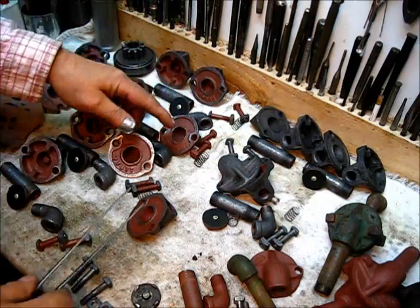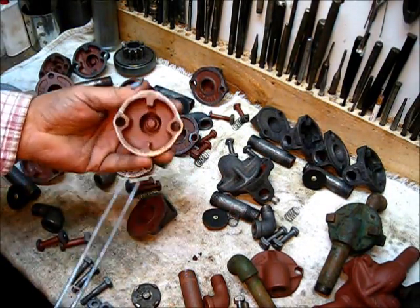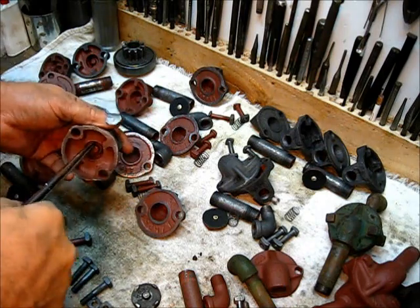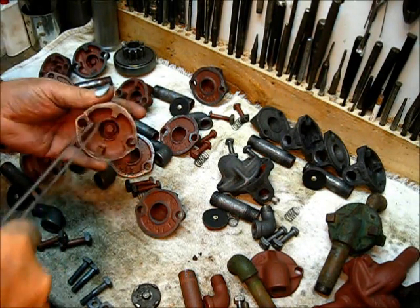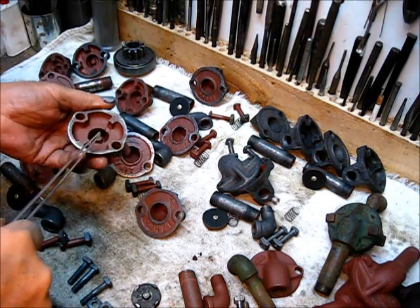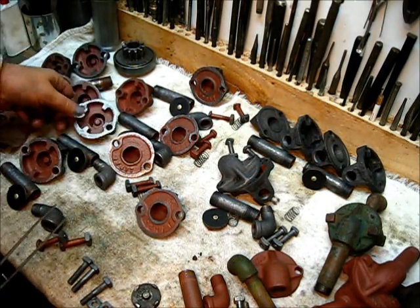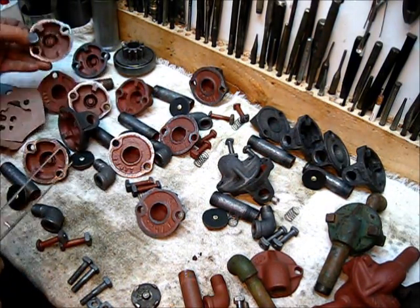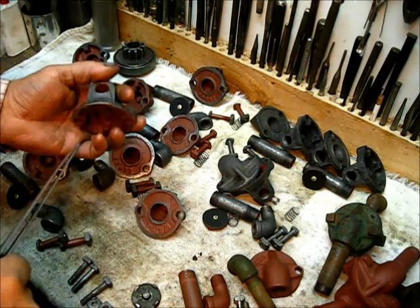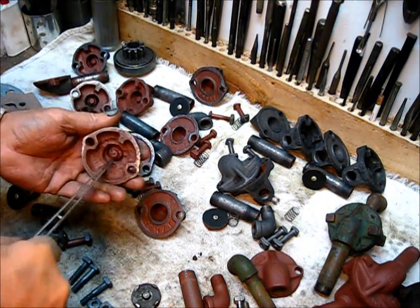Another fairly uniform one — you'd have success with a gasket there. Also note the opening down in there where your outlet is. In one casting it's completely open — nearly 100 percent. But this one is worse — it only has two small holes in the casting, and the way it's made you can't break away the flashing because that's what's holding the seat in there. Very bad casting.